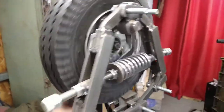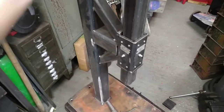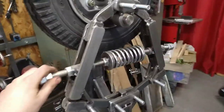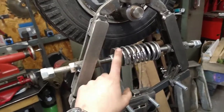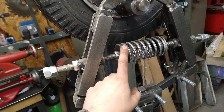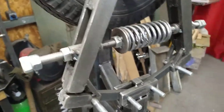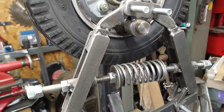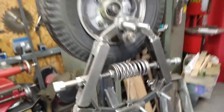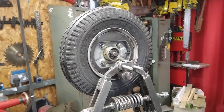Obviously there's the wheel tracks that work the hammer. You can adjust it obviously by tensioning up the spring here. This is a 40-pound spring - I think the way it works is it takes 40 pounds to compress the spring an inch. I've got a 30-pound and a 35-pound spring as well. I originally got a shock off a quad bike which was just too much - it didn't seem to do anything. But this has got quite a nice bounce to it. Another guy I got lots of ideas from for the build is Big Dog Forge.